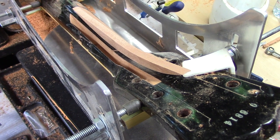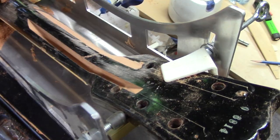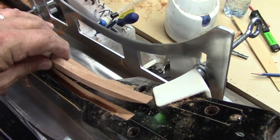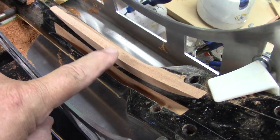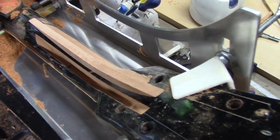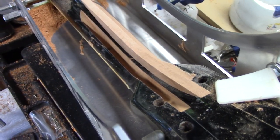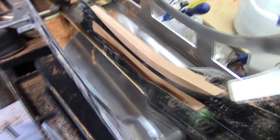Here's the bird's-eye view of that other spline. As you can see, it's in a much different place than the first one, so this has allowed us to sweep into the worst part of the break with the thickest part of the spline. This one goes much further up into the headstock — that's the way this one broke, and this is why I felt it was important to film this.